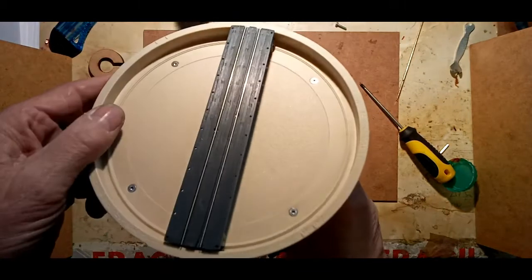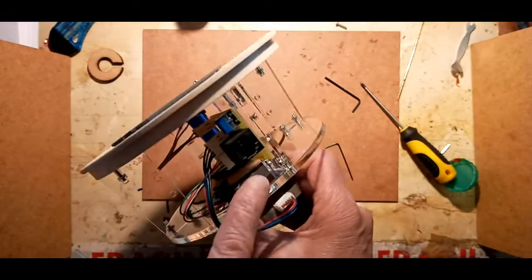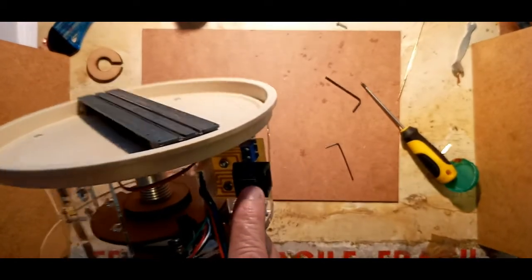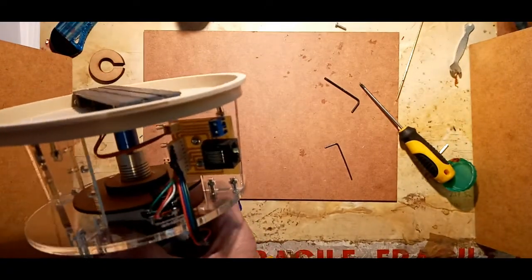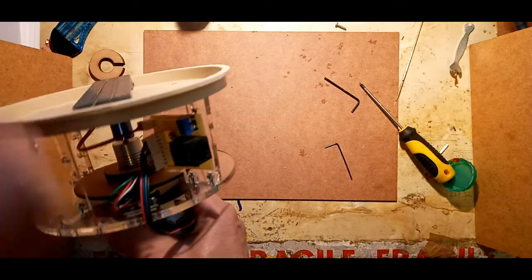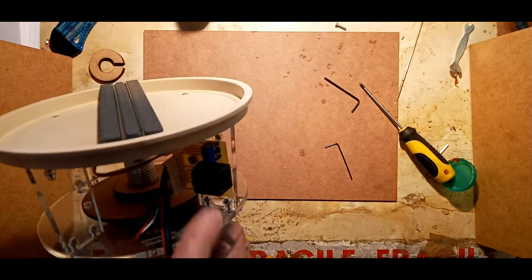There you have your turntable mechanics ready to use. You've got two connectors. One is an RJ45, which looks like an internet connection. It's not an internet connection. Please do not connect it to your internet, because you will do damage to the motor and to your internet. It's a bespoke design for connecting this part to the actual control electronics.